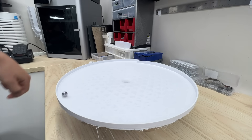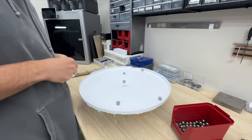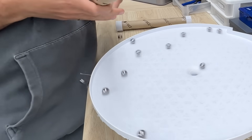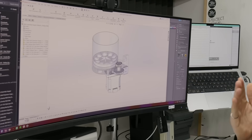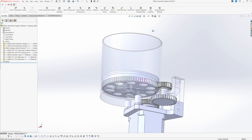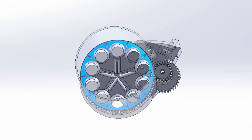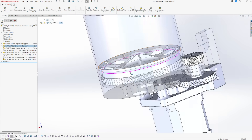Now that the gravity well is rolling, I've realized that I don't have a good way of distributing balls onto the gravity well. I decided to go with this bag of balls and tube method, and yeah, it's definitely not the way to go. So here's what I'm thinking: I took a little bit of inspiration from a gumball machine. It's got this disc that's connected through a bunch of gears to a motor, and as the disc spins, balls will fall into the holes in the disc and will drop out through the hole in the bottom of the hopper.